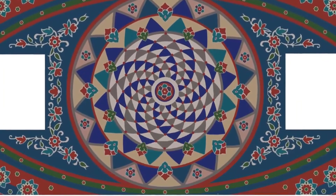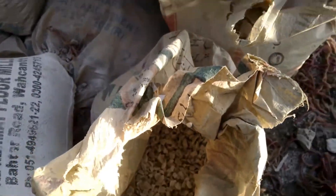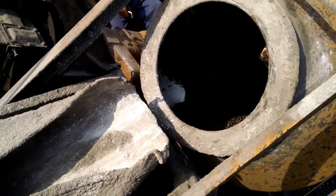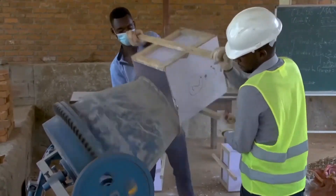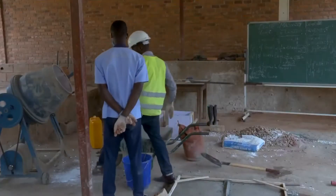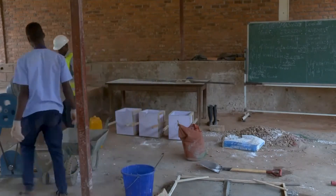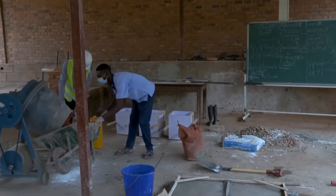Step 3: Mixing of Chips and Other Materials. Terrazzo is a combination of marble, glass, or other decorative aggregates joined with either a cementitious or epoxy binder. Using the specified materials, an installer will mix the aggregates, epoxy resin, and epoxy hardener together to form a terrazzo mix. Mixing of the chips, cement, and color oxide must be batched precisely. The different sized aggregates must also be batched equally so the material is consistent throughout the finished product, with no patches of smaller aggregate or any discrepancy in color. Mixing of material is done by a cement mixer on site.